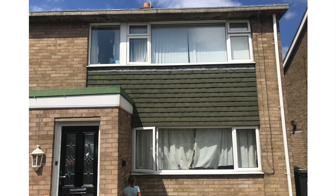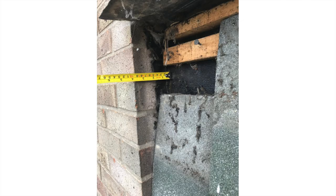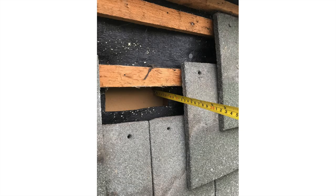My house has a tiled panel on the front and on the back, and I want to take those down and insulate them. You can see it's about nine centimeters to the felt, and then behind the felt there's a further seven centimeters of cavity. After that it's just fiberboard and plasterboard, and then you're into the house — there's really no insulation in there at all.